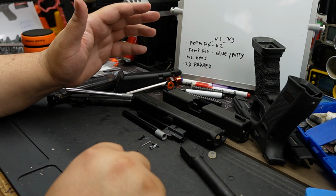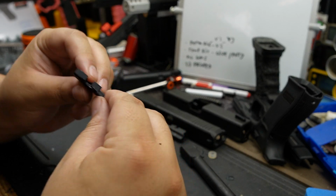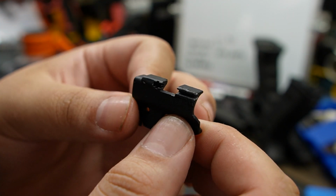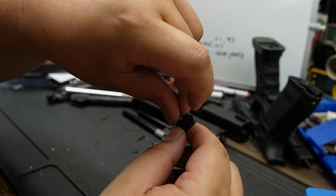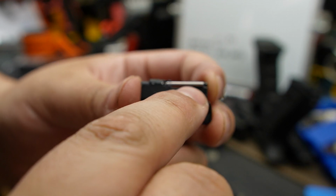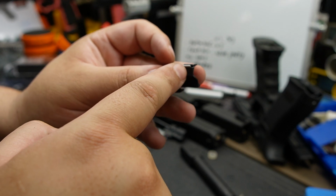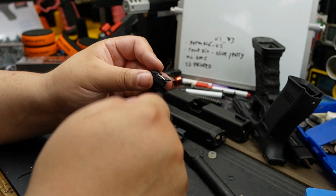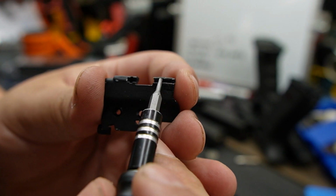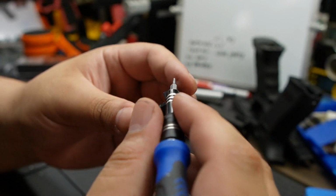As for the permanent fix, we have Leviathan coming in with a very good idea. I'm just a little bit worried about how much room we have, so I'm still going forward with my idea, and we'll talk about it. But I really like what he's talked about. His idea basically is, you see this, you would need to shorten this maybe about 4 millimeters. Cut it off 4 millimeters so you'll have space, and you're putting a screw behind the rod, right? So that is locking it in place. You kind of have to tap it somewhere here and then screw in, and you're gonna put a little screw right here, right? And that's it. It holds in place.